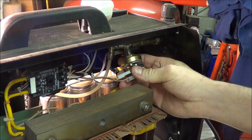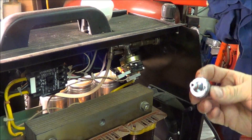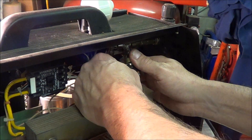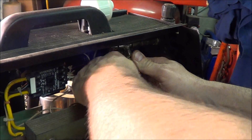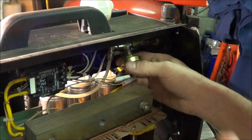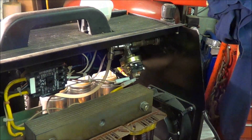What I have left to do is install this pressure switch on the other side, put this air filter on the inlet line, and cover it up and we'll give it a run. So let's spin this thing around and change out that pressure switch. This is a higher rated pressure switch than this one, so we'll just take these two wires off.